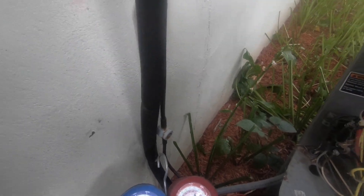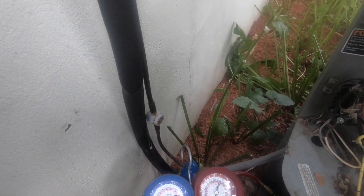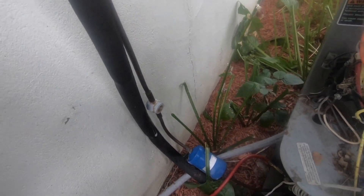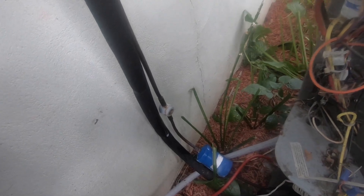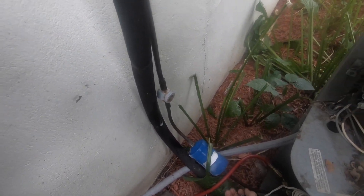There's the compressor — it's starting to make the sound of a restriction. That little rattle — you'll hear that if you have a restricted unit. Because we do have a restricted unit now, we're pumping down in here and I don't want to damage the compressor.